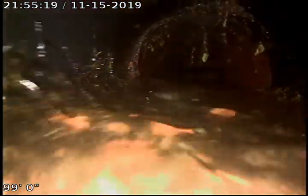And there's roots here. I think that might be ABS. Yeah. And again, it's holding back water, so that's probably no, that's still clay. And we are going from ABS. Okay. So we've got problem. There's the ABS. Got it. So we've got problems all in that clay lateral.